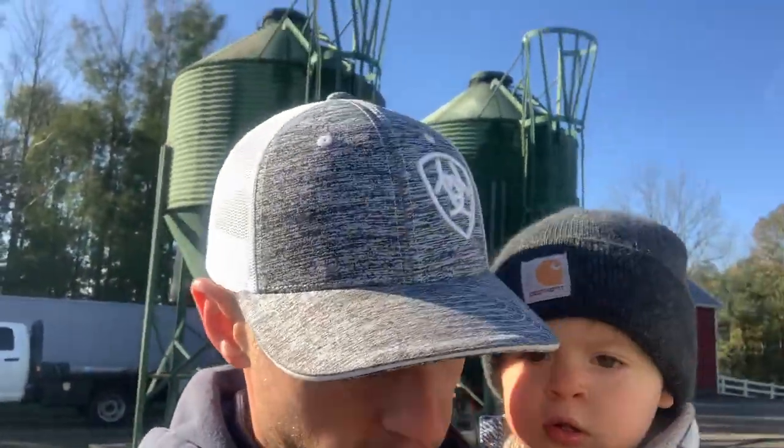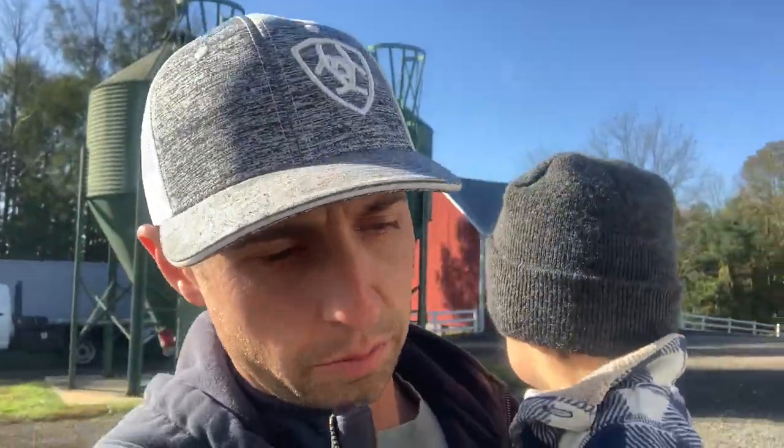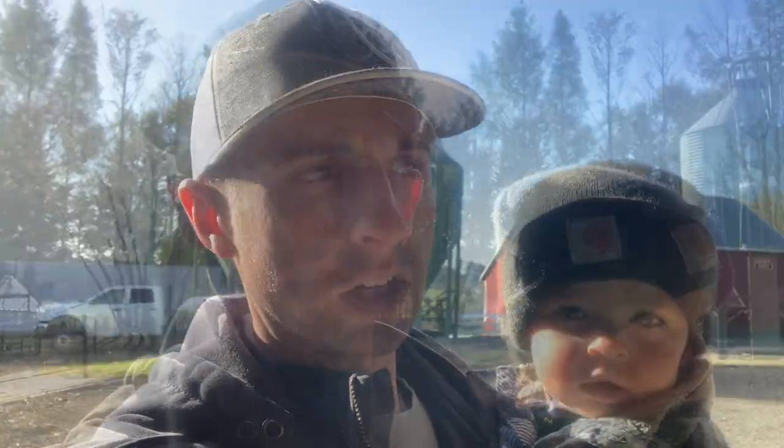All right, truck's warming up. We're gonna go get the bale spear off the tractor. Actually, we're gonna check the fluids in both tractors. Bale spear off the tractor, bucket on there. There's a ball on the bucket that we use to move trailers. That's got to come off so that there's a hole there. We're gonna use that to pull the Grain-O-Vator off the trailer, and then I'll hook it up to the other tractor that we have to switch out the PTO from 1,000 to 540. We'll show you that, and then we should be in business, and we'll test this. We'll check the fluids in the grain cart, grease it, hook it up, test it. Should be a good day.